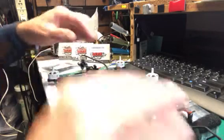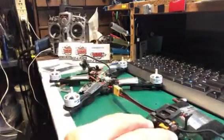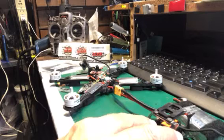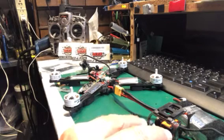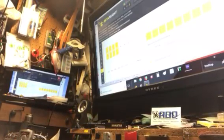If I go ahead and unplug it, plug it back in, it goes through its calibration thing again. But there's no motor spin-up at all. Can't tell which way the motors are going — nothing. It is not showing me anything in the way of total calibration of the ESCs.